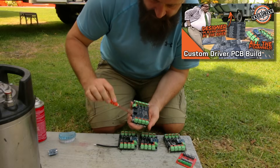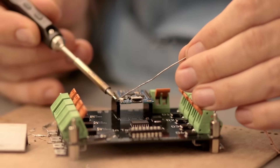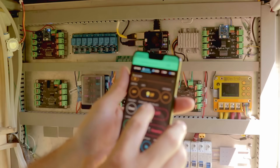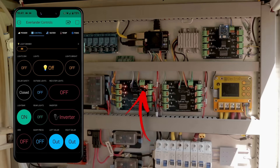I tried to improve our lighting controls during the pandemic lockdown in Mexico. I designed and built what would eventually be infamously dubbed the TOD boards — 8-channel MOSFET driven boards powered by an ESP8266. This allowed me to retire the original volume knob LED dimmer, and then I just used Blink to tie everything together, finally achieving the level of control and automation I'd been craving.